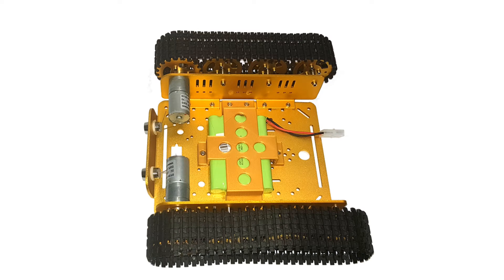Here I've added a 12 volt remote control battery pack to the underside of the robot, in this case using my own 3D printed bracket. If you don't have a 3D printer then you could use cable ties to hold the battery on instead. The battery comes with a Tamiya connector and I wired up a corresponding connector to connect that to the circuitry. You can buy those pre-wired if you prefer. You'll also need a separate battery charger as I haven't included that in the design.